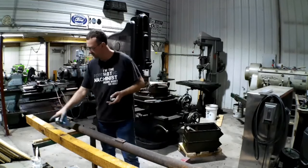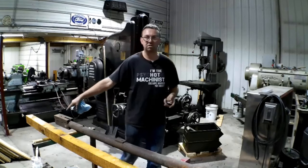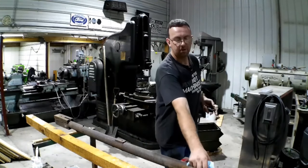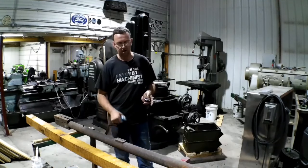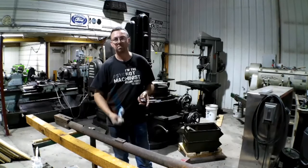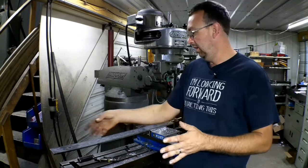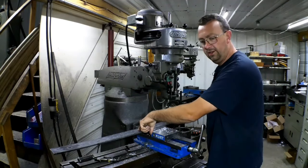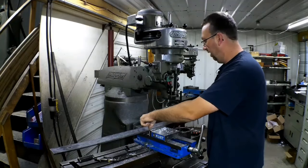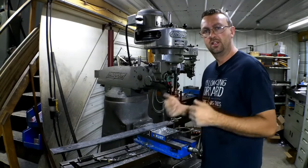There are a couple of plates that'll go back here as stiffeners, come up a ways on each side where the pin goes through — it's already drilled for the pin. Then there's the clamp on the tongue end with two holes for the pin. That'll probably get a lift handle and a hoop on the bottom to keep it up off the ground. These are the plates that go on either side of the tongue where it meets the wagon. I'll drill two half-inch holes on both of them, then drill through the tongue and bolt it all together for a little more strength.